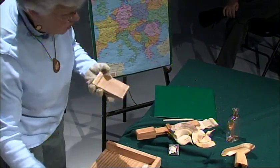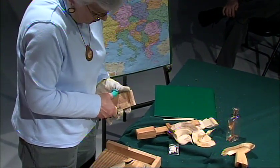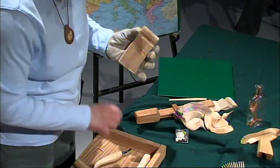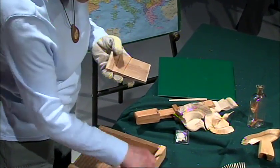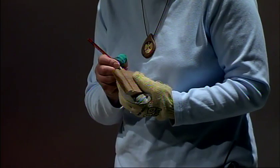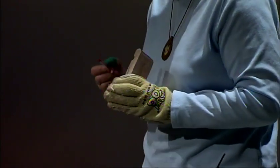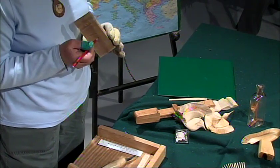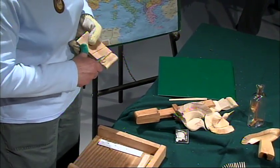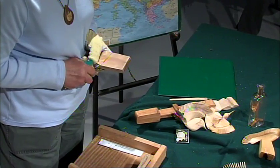With this in mind, I go back to my Scorp, come across here, and put the Scorp line all the way across. The Scorp is really advantageous at this point to get that all the way across because it's going to serve as more of a stop cut. This is a hinge we're making, so we want it to taper down plus have an angle — we're making a V-cut with a long side and a short side. We can start our cut like this and come down. I try to work away from myself; it's more comfortable for me to do that.